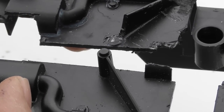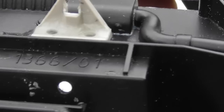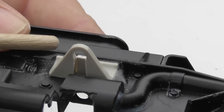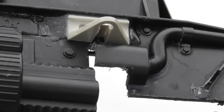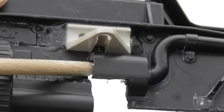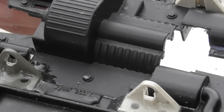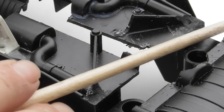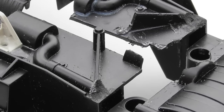They're lined up to roughly the same place, so you can see how that comes down and lines up with the end of the transfer case — that way I knew I could get everything square. It worked out that the axles pretty well sat over the centre of where the springs were on the original model.